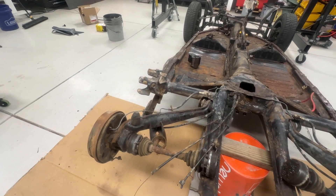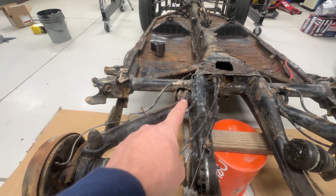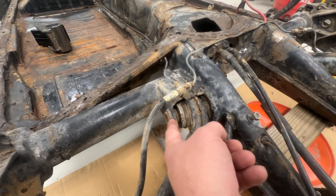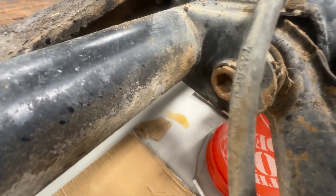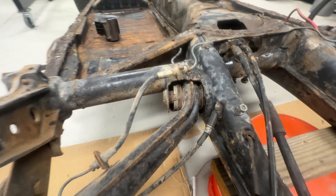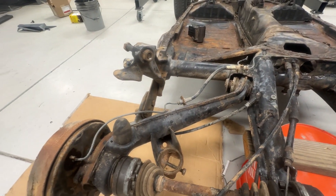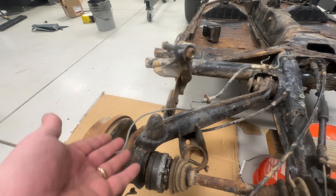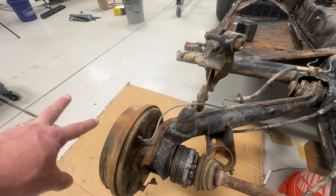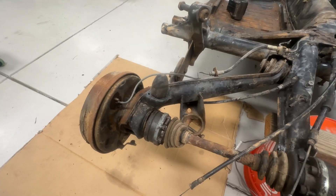I don't have time for a full brake job right now — the race is in two months. So I'm going to go ahead and take this bolt off. I found that the head of a 7/16-inch bolt fits right in there, so I'm going to weld a nut to a bolt so I can get in there and take those things off, move the brake lines, drop these off, cut the perches off, and prepare them to weld with the brakes and bearings all in there.